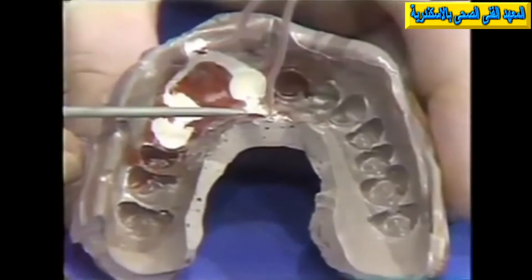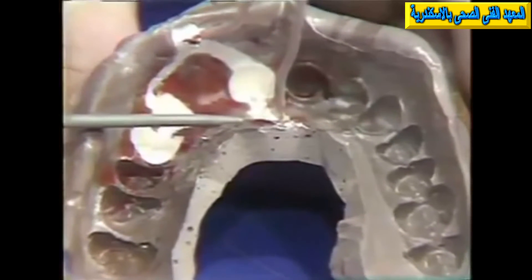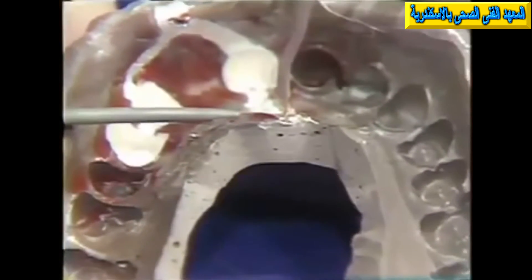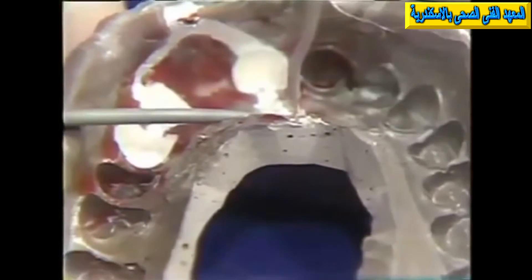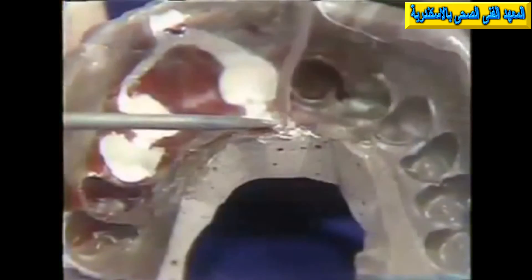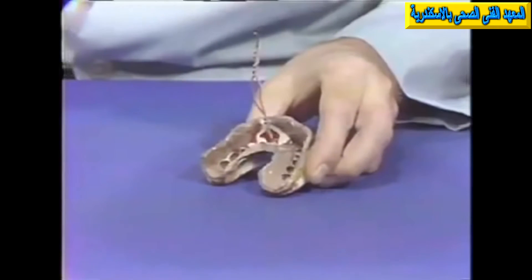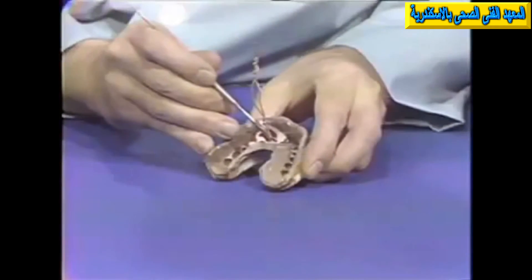The plate should be a milky white as you see in the film. If there are any areas that are not plating properly, at this time we can go back and reapply some silver powder to those areas. We would also block out the leads to the wires at this time so that we don't get any excessive amount of plating. A little additional wax will insulate this area and permit us to be frugal with the amount of silver that we use.